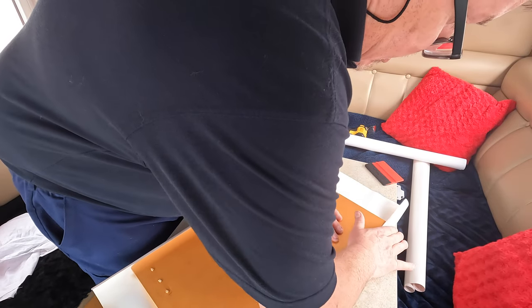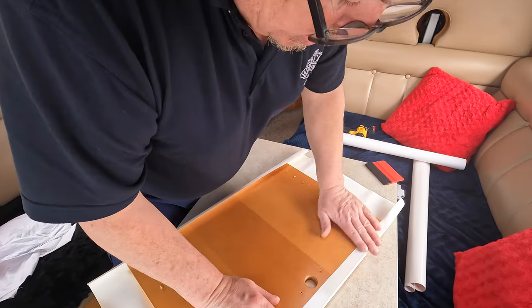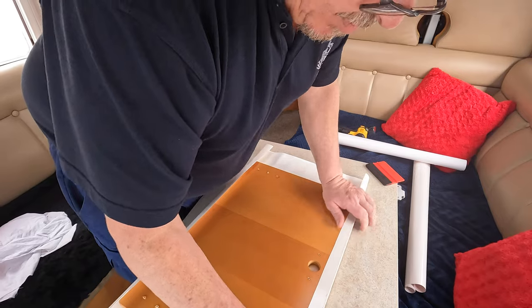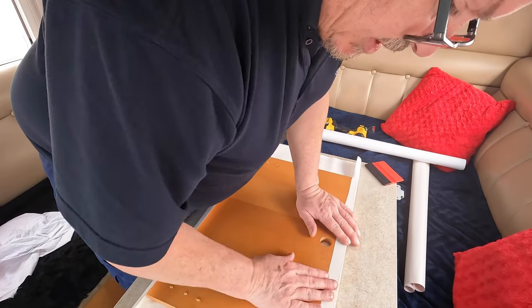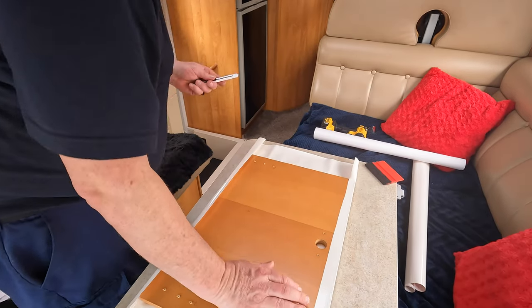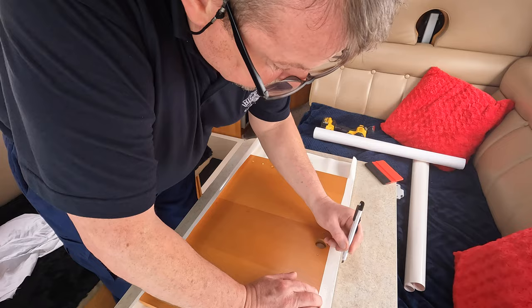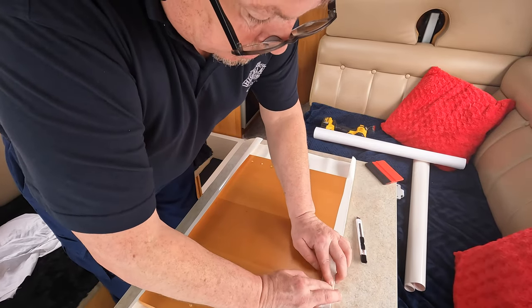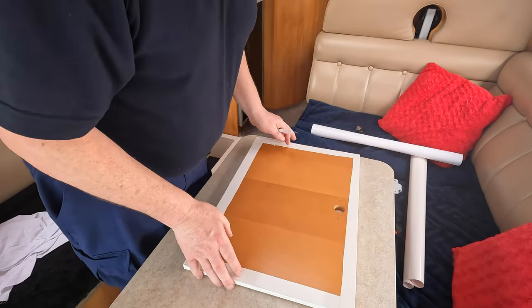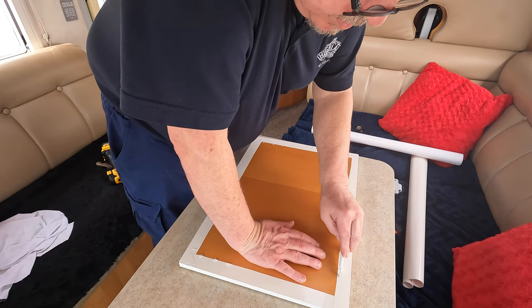People do say you can use a heat gun to stretch it around corners, but on a plain cupboard I don't think there's any reason to. You may see a little air bubble on the corners. When you see a little air bubble, you can either peel it back off, or just get your little knife and poke a hole — the air will just squeeze out. Looking good. It's a little bit uneven on the edge so you can just go around and trim it off nicely in one movement.